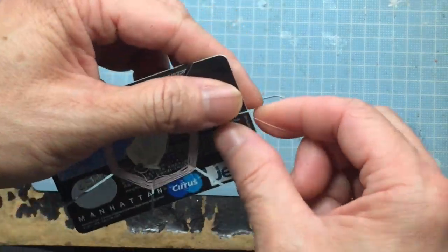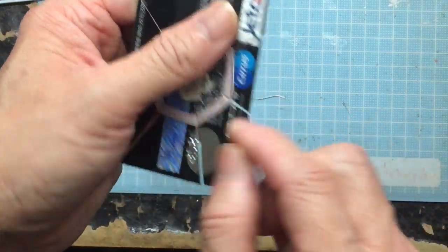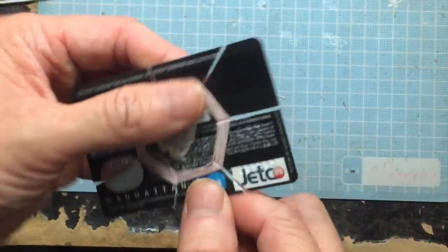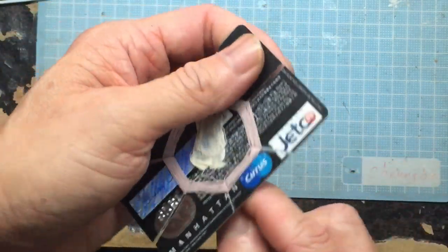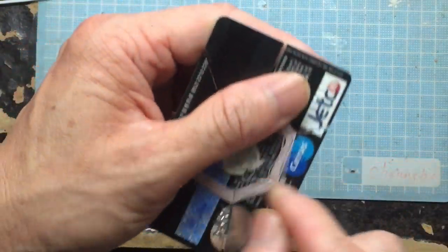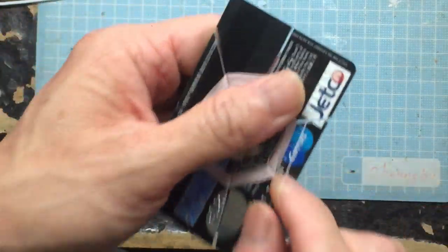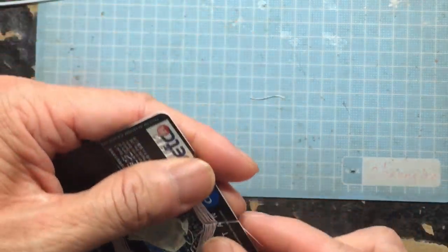So how much force do you need to wind it? Just use sufficient force, but don't use too much force, otherwise you will tear off the wire. You don't want to leave them loose, otherwise once you finish winding, the wire will come out and get loose into a bunch, and it will be very dirty and difficult. It will catch dust, and it will easily be torn apart. So just make sure it's tight enough, but not super tight, otherwise it will tear apart when it goes through the hot and cold cycle of your weather.